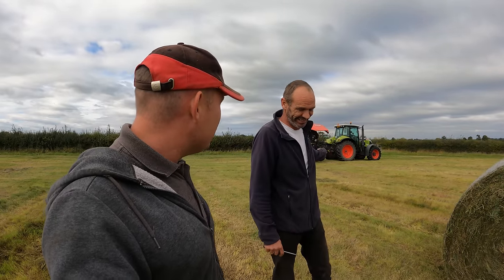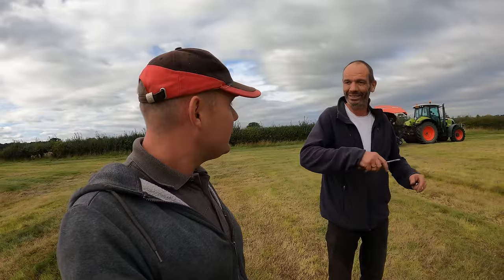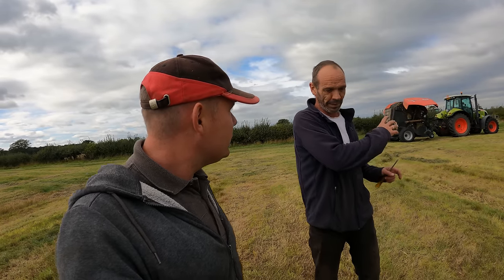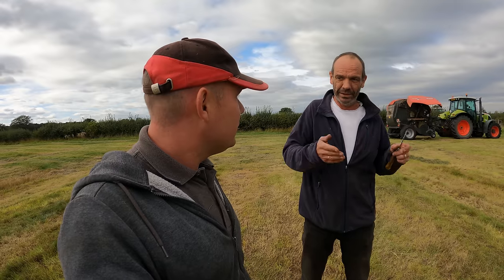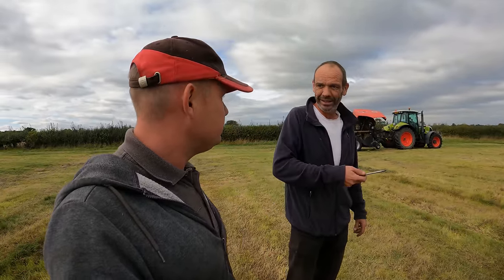You made a big one. The net broke, it finished, and the buzzer went off. So I pressed the button to turn the buzzer off - of course it sets it back to manual. I forgot all about it and it carried on. Is that a normal thing? It's so that if you're working on the machine the knife won't trip in. If it puts itself back to manual it can't automatically activate if you did something that untripped it - safe. It's just one of the things you've got to get used to on it. The other one never did that, so you've got to remember to put it back on.